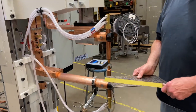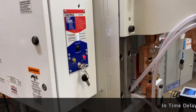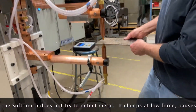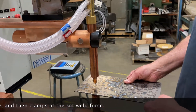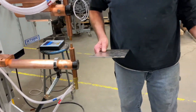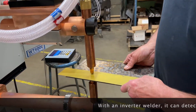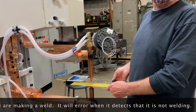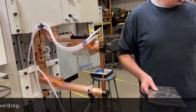Now we'll do the time delay. Time delay is going to go through the sequence no matter what because it's on a time delay, so it's going to take a while to make it weld. There's more of a pause before it welds, but it'll still give us pressure. It tried to weld through the insulation. So there's the two modes of operation.